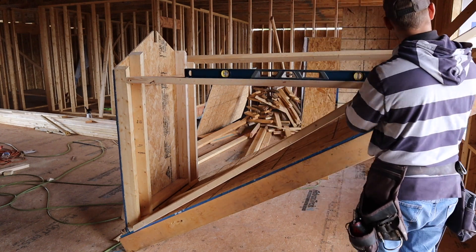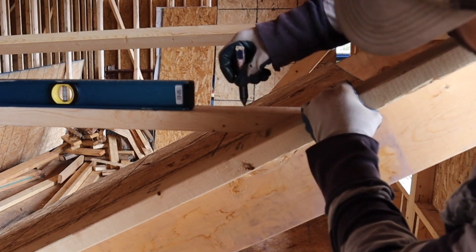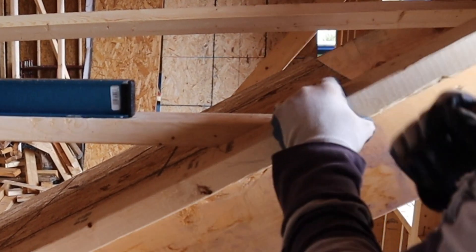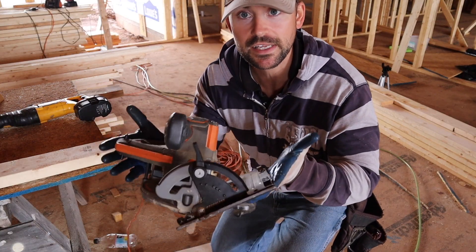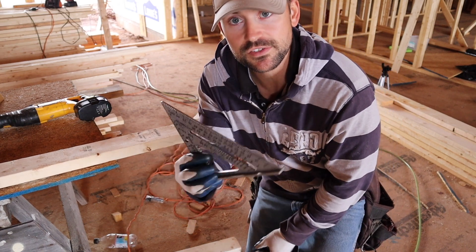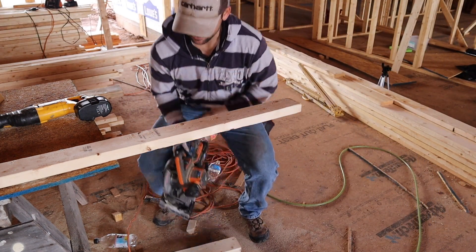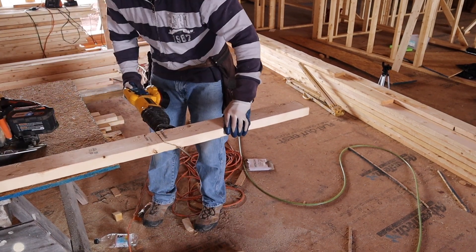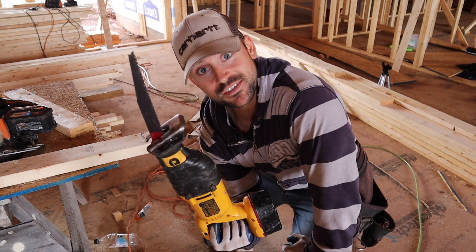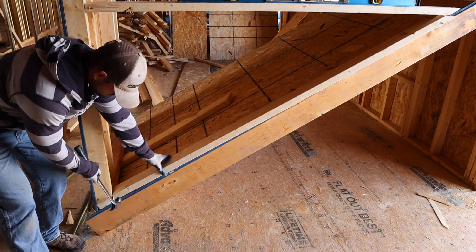Take that 30-degree beveled board, slide it where it goes, let it overhang a little, come up to where the bottom intersects, make sure it's down nice and tight, and make a mark. Right here we're going to make a bevel going this way — that 58-degree bevel — so it continues that same slope. I've got my saw set at the bevel, so come over to that mark, put a straight line on it with your speed square, and cut it out. I had to finish it off with a sawzall because the blade wasn't deep enough. Nice and snug.